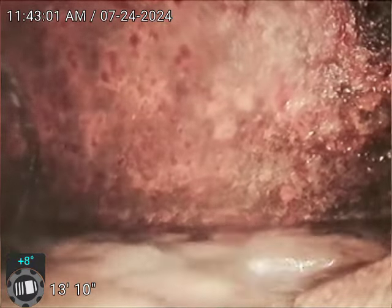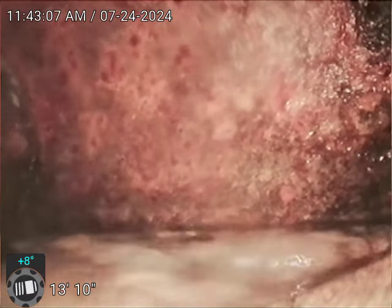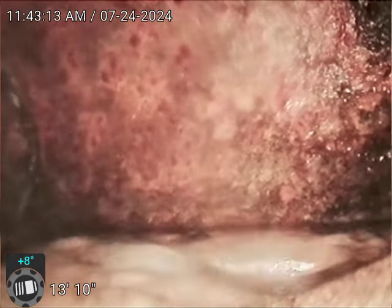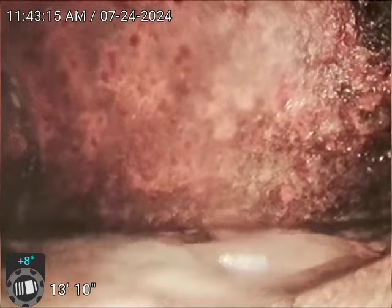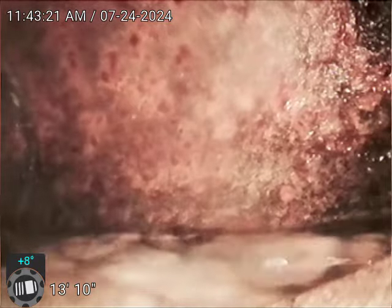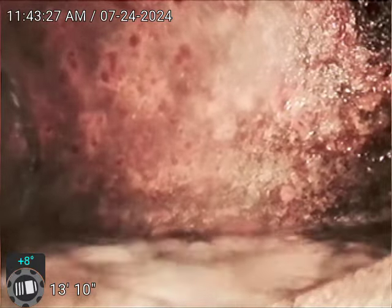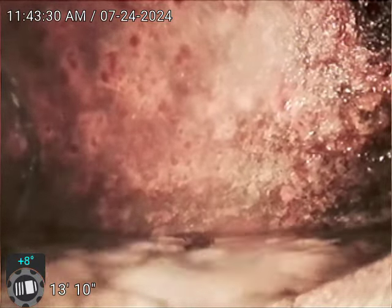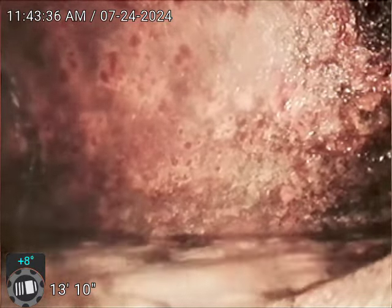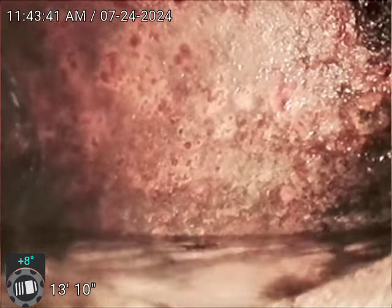So this connection also is the shower in the ladies' bathroom. We're going to shut the shower down, take a minute for the water to stop, and then we're going to check and turn on the lavatory sink in the ladies' bathroom. So this will be number 4 connection. So he's running the lavatory now. Not yet. We're still waiting for the shower to stop.